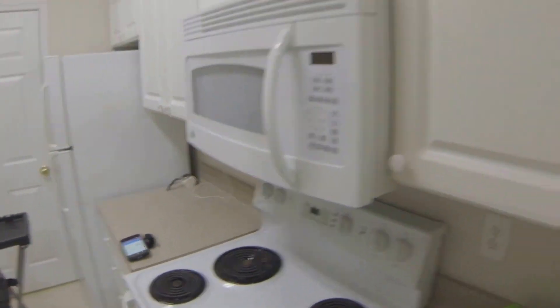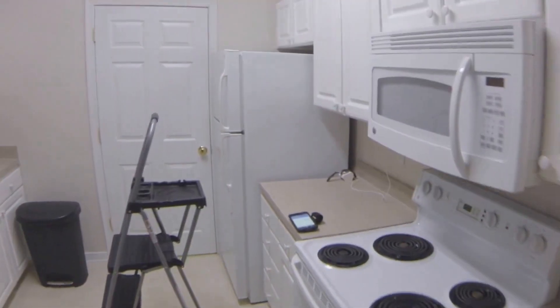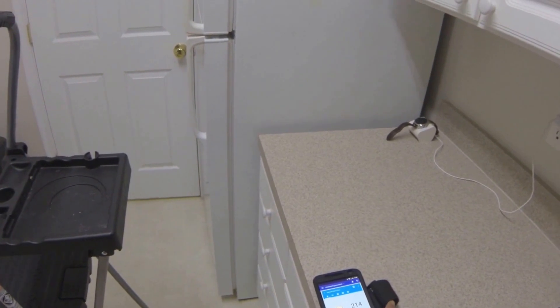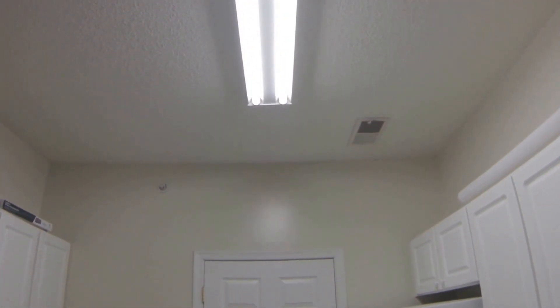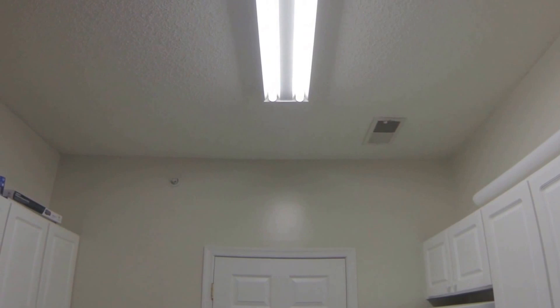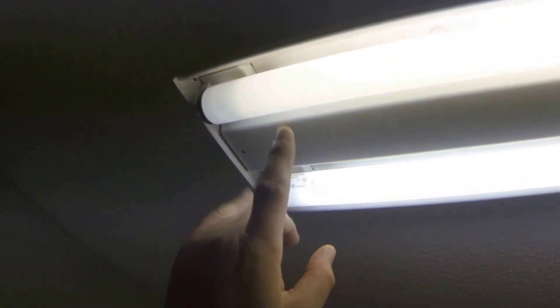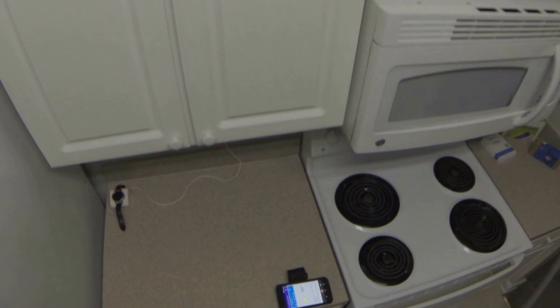But that may be off by a little. Let me turn off all the lights in the apartment. So as it stands, I'm getting 214 lux, and that's being put out by two 40-watt fluorescent tubes. These haven't been installed very long, but you can see if we get a little bit closer that they are 40-watt. So two of them is 80 watts and it's only putting out about 210 or so lux.